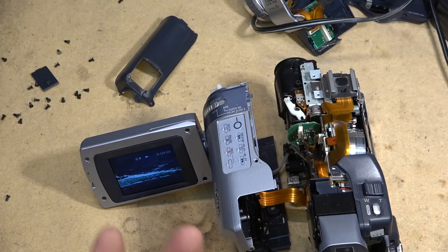Regardless whether it's an optical system or a magnetic system, you end up with a switching signal that goes high, low, as either the magnetic field rotates over the Hall effect device, or the alternating black and silver stripes that are painted on the bottom of the reel hub pass over the photo sensor and reflect the light. It counts these pulses, and that's how it verifies that the take-up spool is actually turning. If the take-up spool were to stop, it goes into an emergency shutdown and throws a code on the screen.